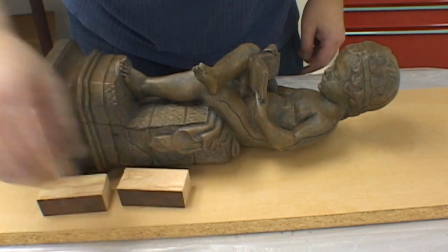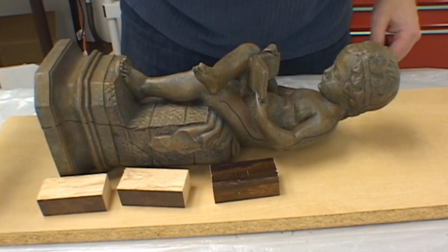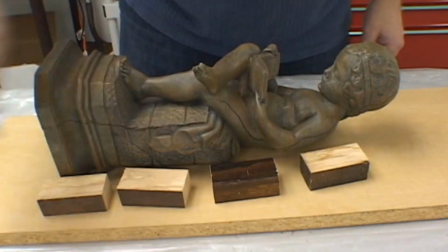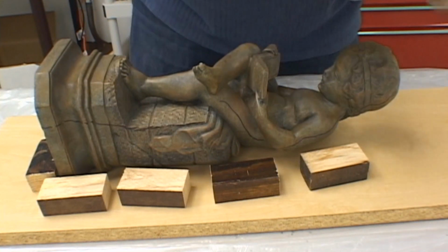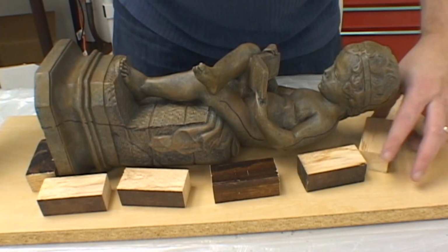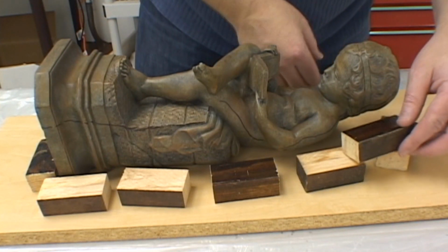After we have completed laying out the parting line, our next step is to set the model on the modeling board and block it in using small wooden blocks. Now the idea behind this is to actually save ourselves some time and effort in laying out the parting line on the model with the blocks.